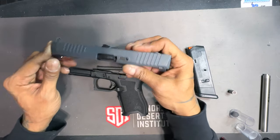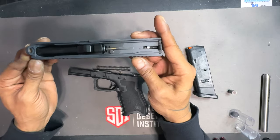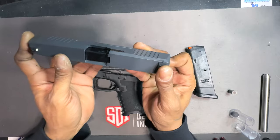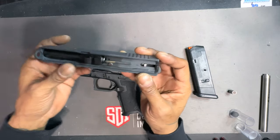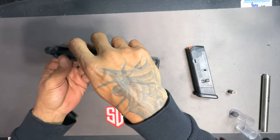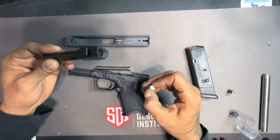Unlike with the go gauge, there's not even enough room to get this to go under the extractor, and you don't want to apply pressure with the no-go gauge. As you can see, the barrel is not able to lock — it's clear to see. That shows you that the chamber has the correct headspace. This concludes my week three assignment for FTH 21251915. Thank you.